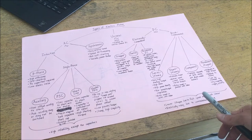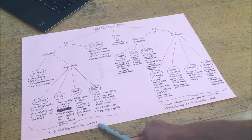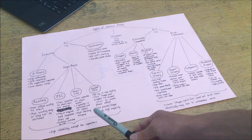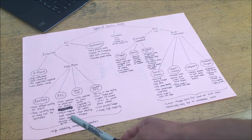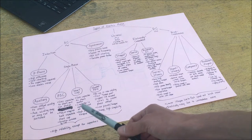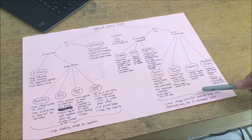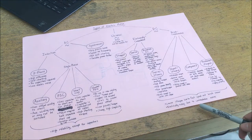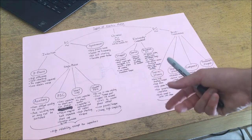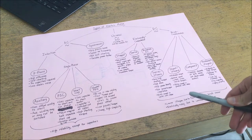The last thing before demonstrations: regarding reliability and long-term performance, induction motors are ideal for applications requiring very long running hours. They have no brushes so there's nothing to replace electrically — only the capacitors, which can dry out over time, and the bearings. DC motors have much higher power density and are faster, but the brushes wear out quickly and so do the bearings. Another problem with brush-commutated motors is commutation noise — every time the commutator rotates it creates large spikes in current draw, which can produce unsatisfactory noise on the power supply circuit.